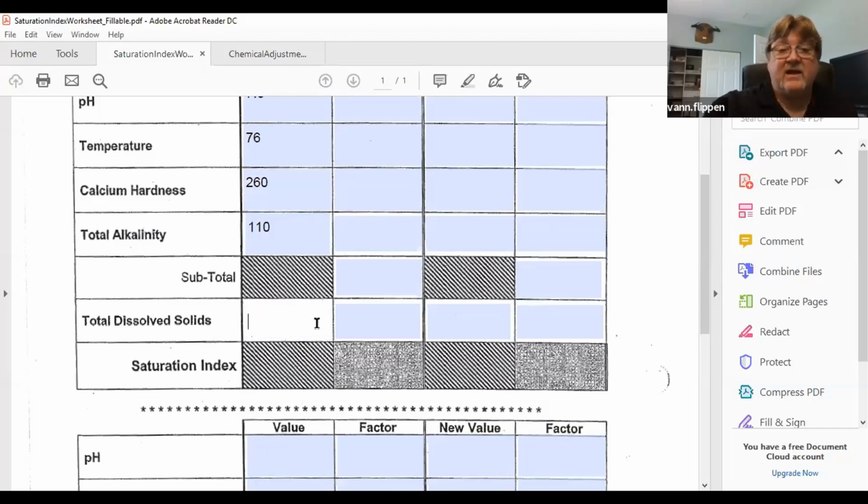And we'll say the TDS is 900. So I started out at 350 and it's risen all the way to 900. Once you measure your city water, you never have to measure it again. You only measure it once and set it and forget it. If there's any variations, it'll be so small it doesn't need to be deviated. As far as your pool water, I'd have it tested for TDS once a year. You're not going to get that much variation.